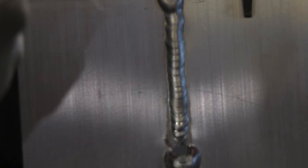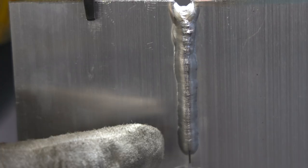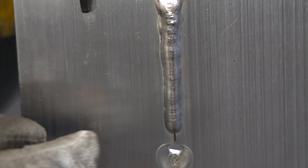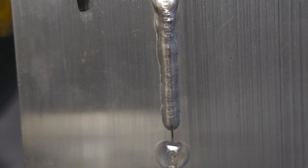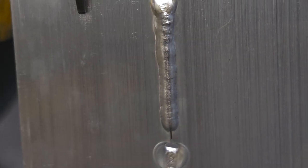So this top run — really nice smooth bead. It's a little bit hot, but I probably could have added a little bit more filler rod and backed off on the amps a tiny bit to get a little more definition. Good toe line, nice smooth consistent bead — it's a little undefined. That's typically what I'll get with overhead: I won't get as much definition, but a nice solid run. Here we've got the backside of that last run — nice even penetration the whole way. It's not biased to one side of the plate; it's a good thick reinforcement. Like I said, it's like running flat, just in a different position.